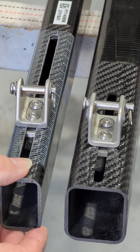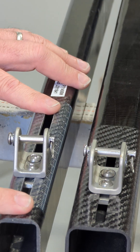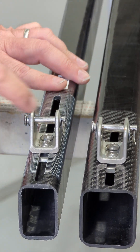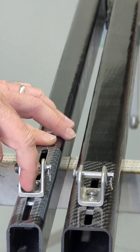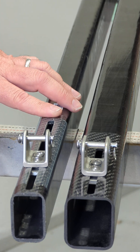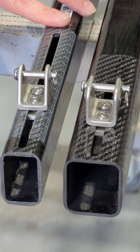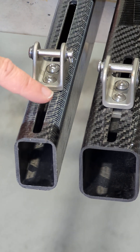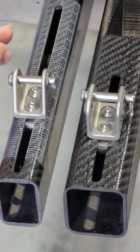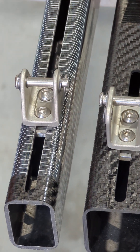We've got top and bottom stiffening as opposed to the old even laminate. We've made the outhaul slot a lot longer this time so we can accommodate a long-footed or short-footed mainsail. We've made some small improvements to this fitting — made it more symmetrical so it's easier to adjust the 6mm bolts, and also significantly increased the clamping power so there's no sliding. We've also added graduations with numbers so it's easy to calibrate and pick your favourite positions once you've tuned it in and get repeat settings.